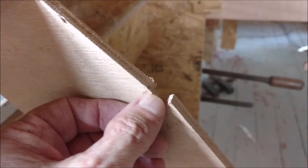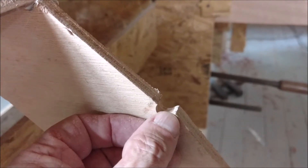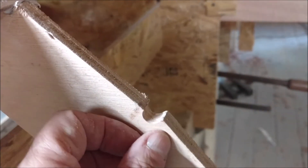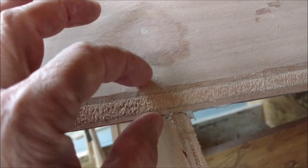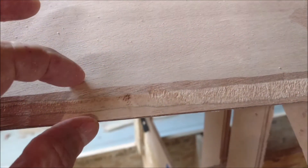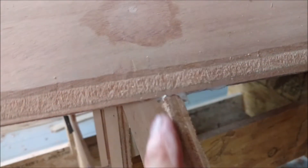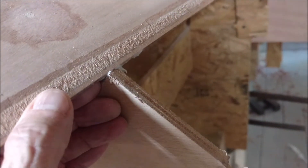If, in fact, you're exposing half your plank right there to the next plank, that needs to be cut away. If, in fact, the width of the bevel is the same everywhere — which it pretty much is — then the triangular section of material you're removing is the same.